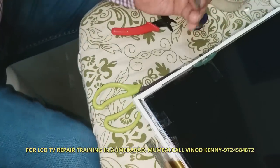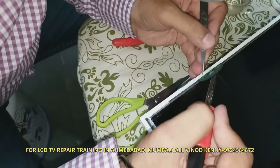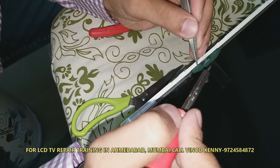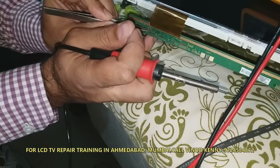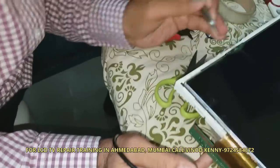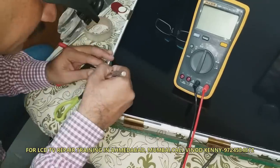Now I am soldering that point. You can see it is a very very thin narrow space where I am soldering — it is very complicated to solder in that area. You have to use a head magnifying glass to see all these small details and get it soldered at the correct point. I have soldered both VGH and VGL to their respective test points, and now we are looking at the picture.